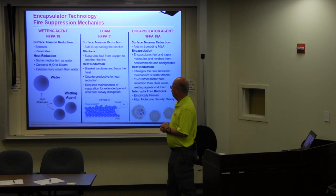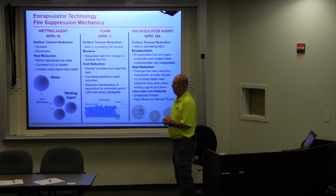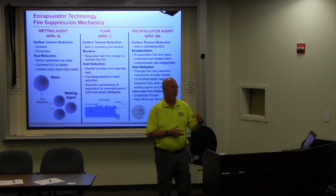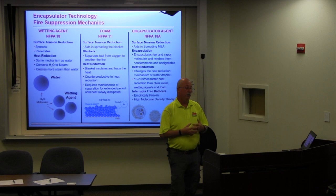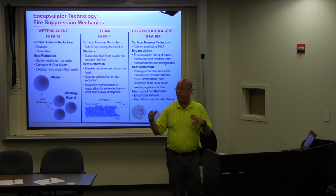But recently they finally came up with NFPA 18A, and they came up with a test standard. When we look at the different products, with wetting agents, as long as you can reduce surface tension, that's where you get thrown in. Everything that we add to our water, foams, they're surface tension reducers. So when you look at Class B foams or Class A foams, if you're a Class A foam, all you really need to do is make bubbles and you're a Class A foam. There's no test standard.